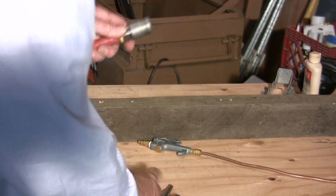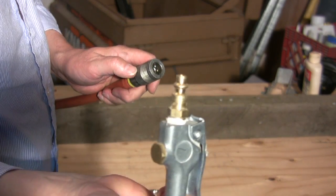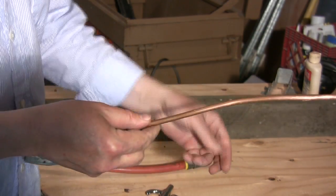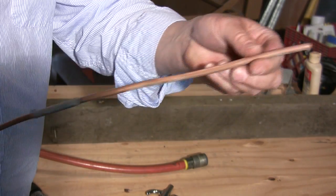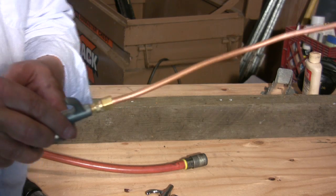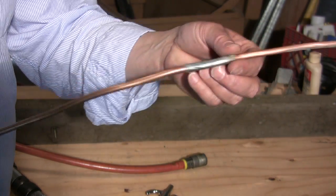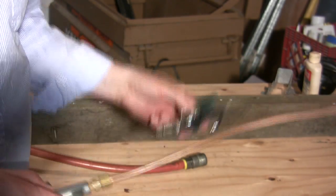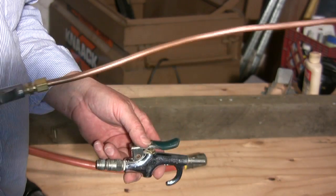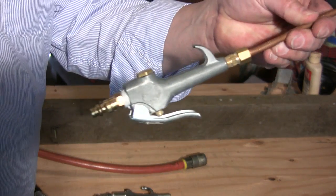Now, a variation on that theme is this. It's actually the same idea as a blower. I can't demonstrate it because it has a smaller fitting, but it's the same idea as the regular blower, only someone had the bright idea of attaching a piece of 1/4-inch copper tubing to it. The reason this is great is that when we do earthquake retrofit work, which we do a lot of here in the San Francisco area, you drill your hole, even a very deep hole, you simply put this down there and you can really get a good cleaning with compressed air. Whereas I used to use this guy and attach a little piece of rubber tubing to it, which works also, but this is kind of the cat's meow. There you have it. Next, we'll talk a little bit about air compressors.